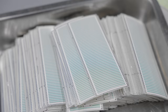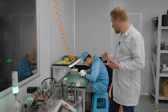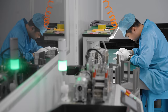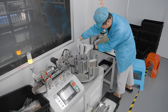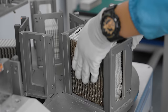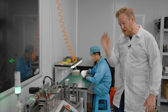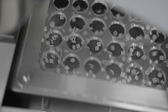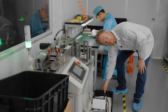Next, the panels come up here for a final inspection — checking for obvious defects, bent legs, or bent parts of the frame. They then get loaded into a machine that uses a sharp roller to cut the tabs holding the LEDs in the frame. Finally, they get put in a vibration sieve that removes any dust or metal shavings before they get shaken down into a bin of finished LEDs.